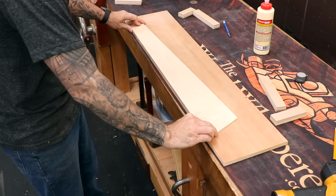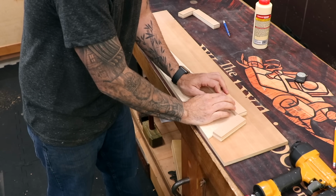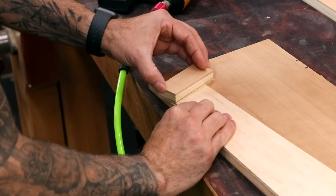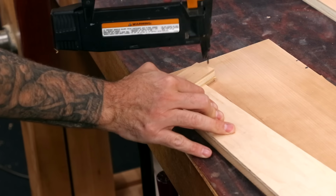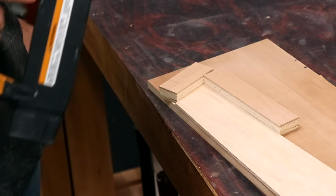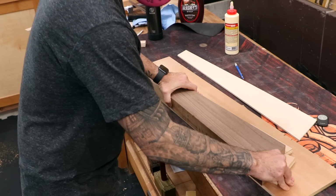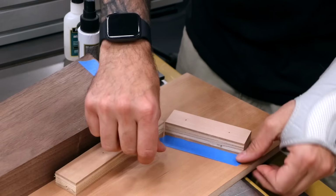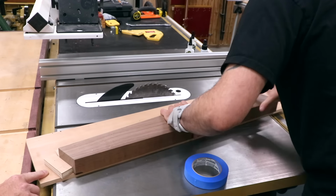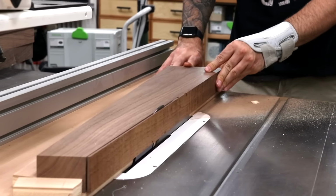The inside tapered edge of the leg is still rough, and to trim those perfectly, I'll make up a simple tapering jig. Using a template for reference on a piece of 1/2-inch stock, I'll attach some plywood strips as stops. The leg blanks should drop right into place. And to further secure the legs, I'll use the CA glue blue tape trick. Now I can easily rip the tapers.